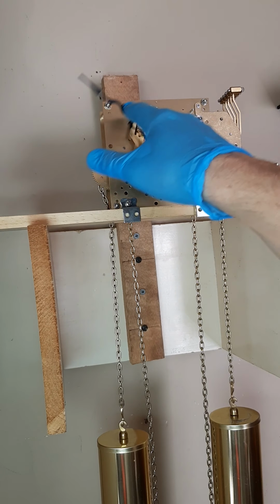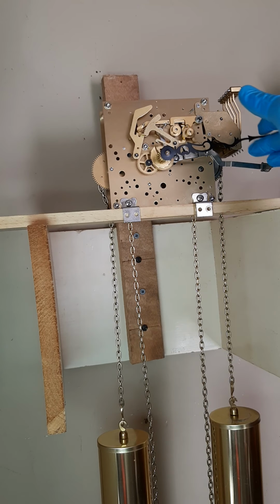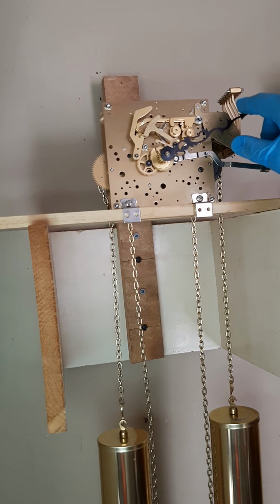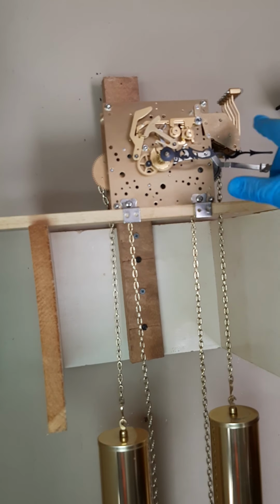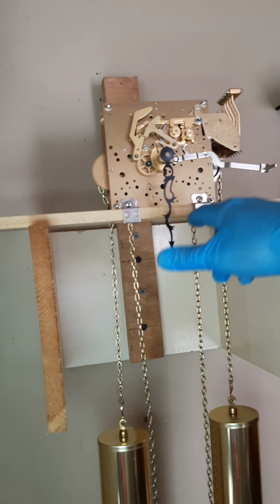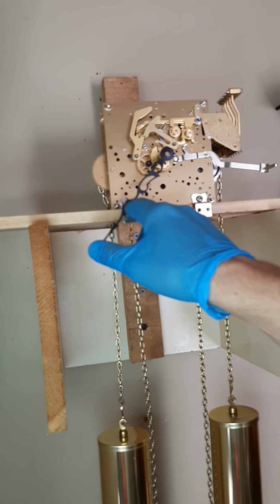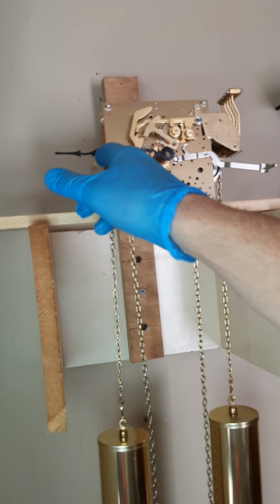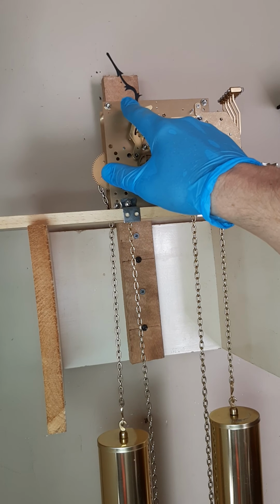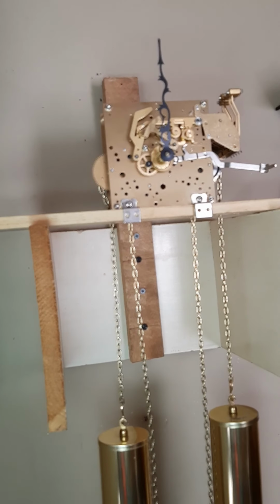See, the last chime that we had was the third quarter chime. Now the next chime's going to want to be the top of the hour chime. But as you'll notice, this mechanism will withhold, holding the chime here, the click. Of course, when the face is on here, you won't be able to see these levers moving and not doing anything. But you'll see the click, you'll hear the click, and then once that minute hand gets back up to the top of the hour, the chimes are now back in synchronization.